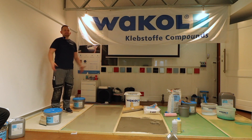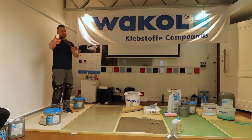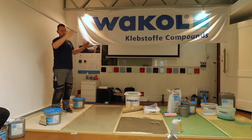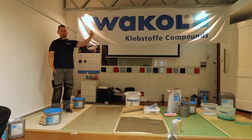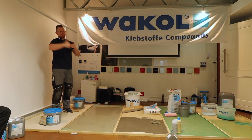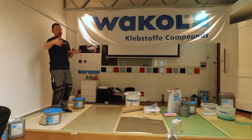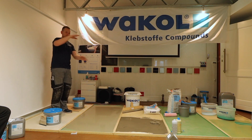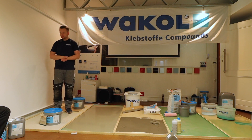For vinyl sheet it depends on how the job site is designed. If you have five pieces of vinyl sheet — typically two meters wide and maybe ten meters long — you fold each piece in half, start installation, and once you've finished two or three lines you can also install the PVC and move to the other side. It's always related to the job site layout.